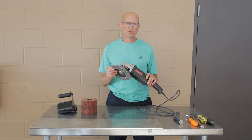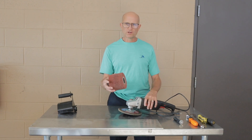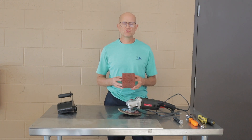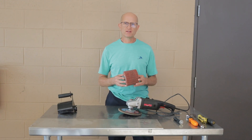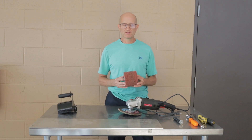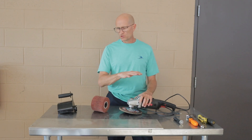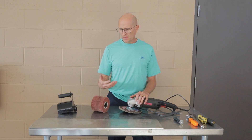Some people call it the contour. What it really does is just convert your rotary grinder to a linear polisher, and this is a really handy tool for getting a brushed finish on either stainless or aluminum. Whenever you want all of your lines going the same direction for a nice even uniform finish, you need to have a rotary tool spinning in line with the grain of the metal. It's hard to do that with a rotary grinder because it's always in a circular motion, so you get all kinds of swirls.